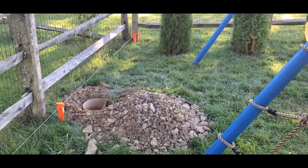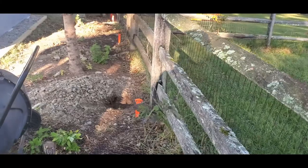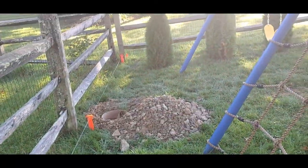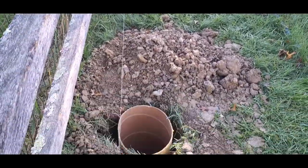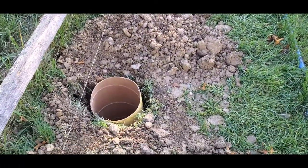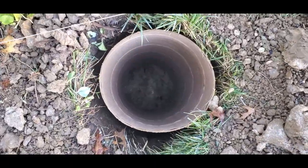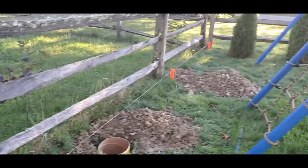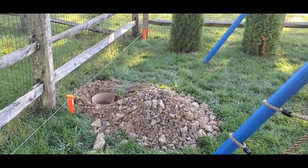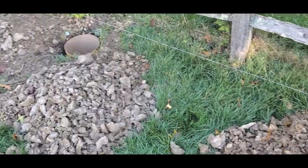In some other videos I mentioned we were wanting to put a privacy fence in. I've already ran the line — that's pretty much the property line; the other fence is about six inches in from the property line. I've dug a few holes down to frost depth, which here is 36 inches, and I've been filling those with Sonotube forms all the way down. I rented a two-man auger over the weekend thinking I could tear these out pretty quickly.